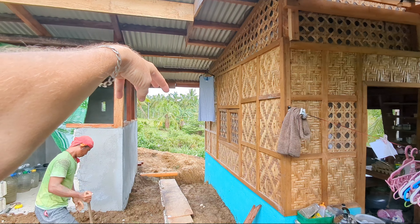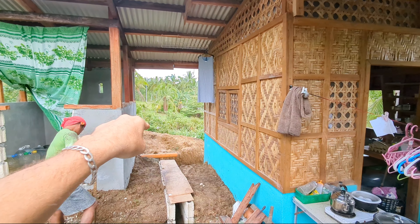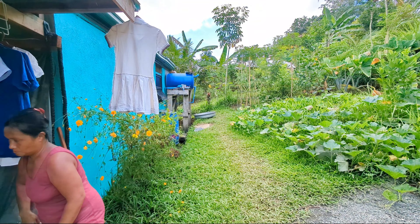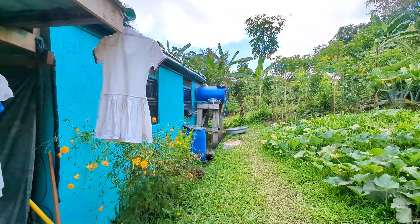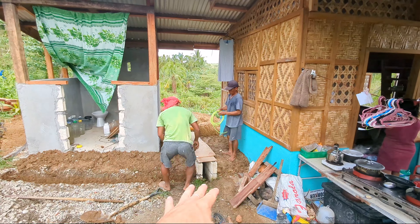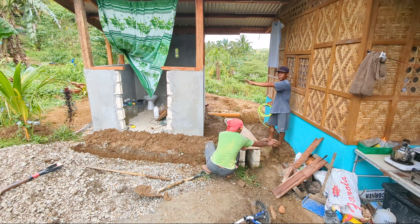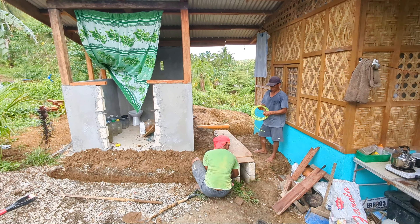So a square 1000-liter tank here, maybe two of those on top of three-quarter-inch plywood with food storage containers on top for dry food storage. And then two 200-liter tanks right there on a stand right under the roof — they'll be the first to collect water, and the excess runs down into the 1000 or 2000-liter tanks. So that's 2400 plus 1000 over here, 3400 total. With overflow we're going to be close to 4000 liters of water.